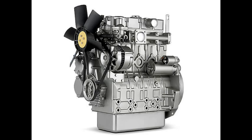Nope, they were thorough. And for engines with flanged cylinder liners, the manual says you got to use shims to get the correct liner height. Right. Shims are like these thin metal spacers that you use to adjust the position of the liner. Oh, okay. So it's like fine-tuning the fit. Exactly. And the manual actually provides a table that lists different shim thicknesses and their corresponding liner protrusion heights. So you can just look up the right shim thickness. Yep. Makes it easy for the mechanic to get it just right. That's pretty handy. This whole manual is like a treasure trove of information. It really is. It's amazing how much detail they packed into it.